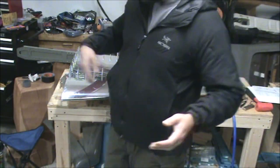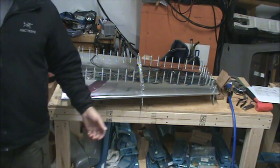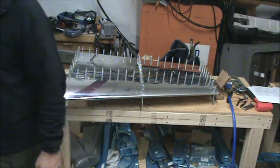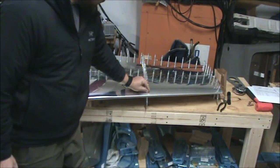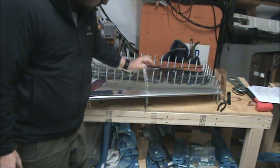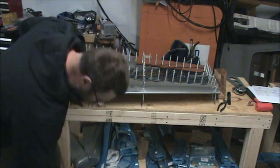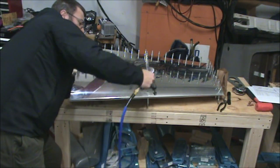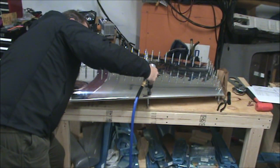If you don't have a pressure controller on your air compressor, you're definitely going to want to get one that goes on the gun. I don't really have a recommendation for that. I could definitely see needing two people for this, especially if you're vertically challenged and have short arms. Basically, you'll have to get used to doing stuff by feel, so get in there, and you know the bucking bar is on the rivet if you can push the rivet up.